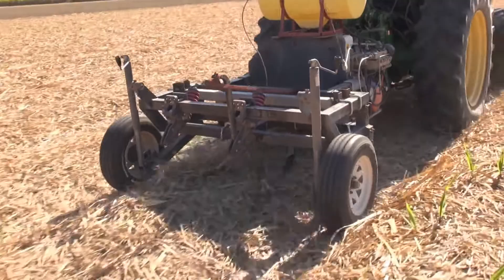So Greg, we've seen Aquatil in operation today. Can you just give us a brief background to the machine? Basically the machine is an ultra high pressure water pump. This particular machine is rated to 60,000 psi which is about four and a half thousand bar. When the liquid converts the pressure into velocity at the nozzle, it's coming out at about three times the speed of sound and effectively it's micro erosion that does the cutting for us.